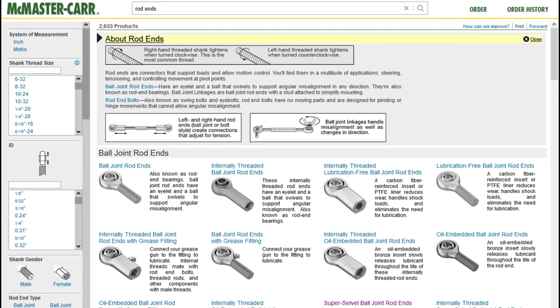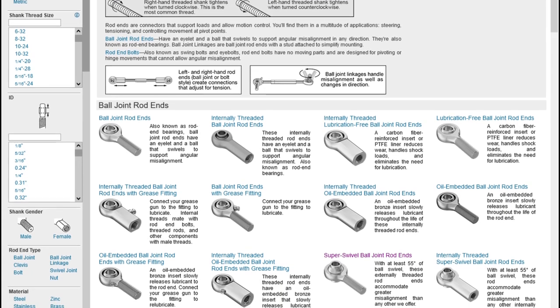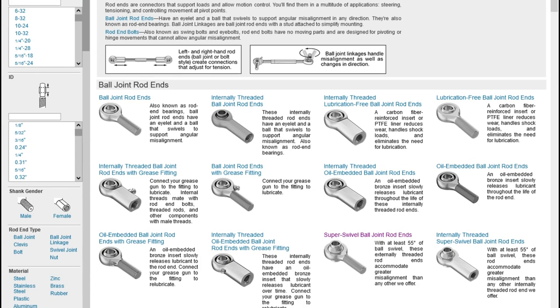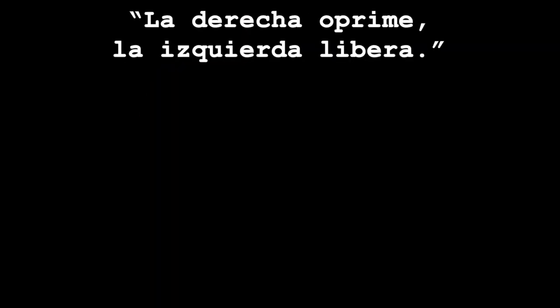The plan was that the crankshaft would be connected to the wing segments through rod end bearings. Rod ends are standard industrial parts for doing more or less exactly this kind of thing, and they come in a wide variety of styles. Specifically, I used these externally threaded super swivel rod end bearings — right-hand threaded on the crankshaft side, and left-hand threaded on the wing side. This is done so that if you turn it to the right, both sides will... You know what? Screw it. We're doing a tangent. Everyone knows righty-tighty, lefty-loosey, yeah? I hate that saying. It's a bad mnemonic. I recently saw 'the right restricts while the left liberates,' translated from Spanish, and while that's more fun, it's still fundamentally flawed. Using left-right to describe rotary motion just doesn't make sense.